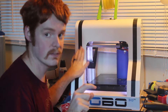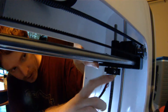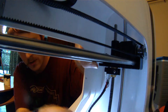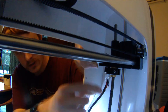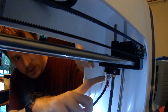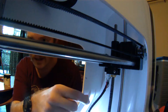If you do have a more pronounced problem where you can actually see a gap, especially on the left side, you can actually unhook these two wires here, and this whole piece from here down will rotate and you can run it up and down the shaft. Just make sure that when you are done, the wire terminals are on the front facing of the machine, not back here, so that you can plug everything back in correctly.